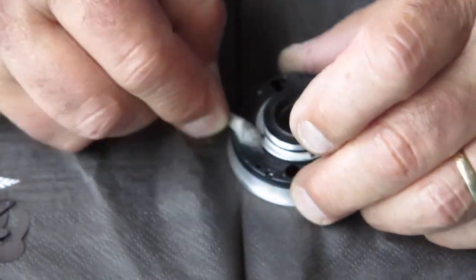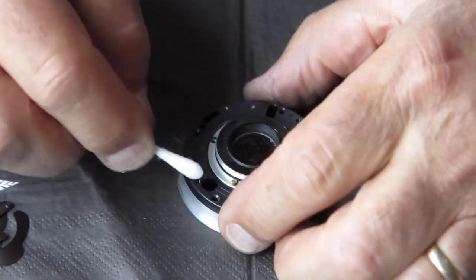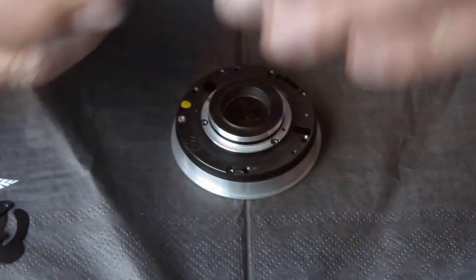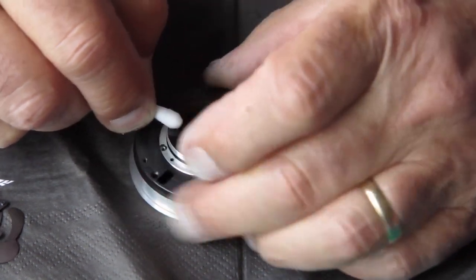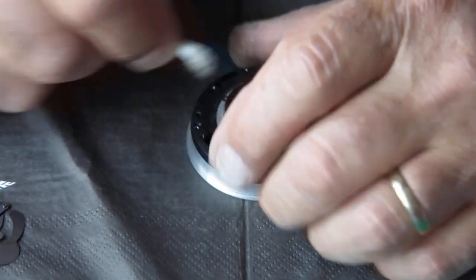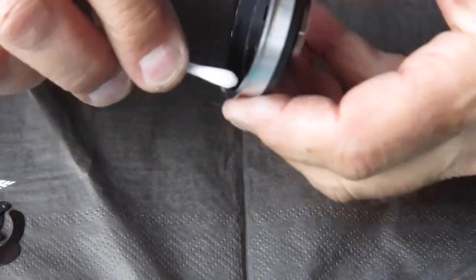The problem with oil is that over time the volatile components tend to vaporise and then condense on some other handy surface, which is frequently one that you would rather they didn't condense on, like the glass lens or the shutter blades or the diaphragm blades. The outside of the case in particular, of course, being fairly open to the world, tends to gather up dust and stuff like that.